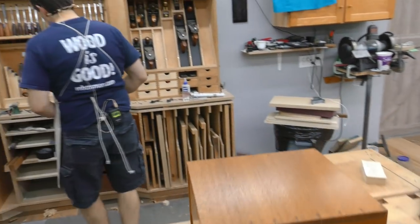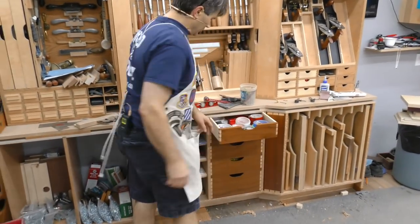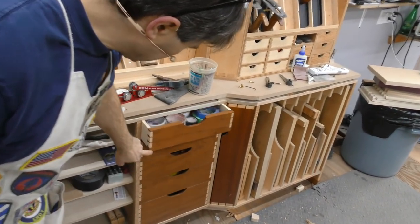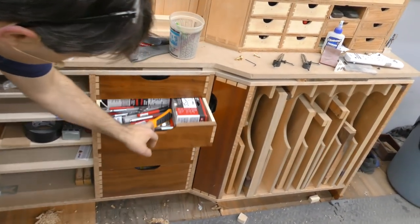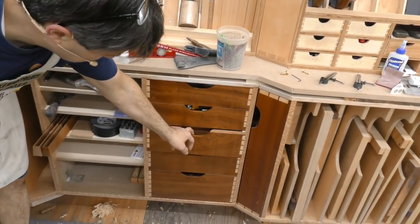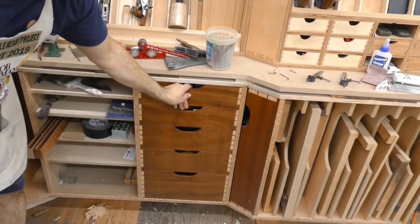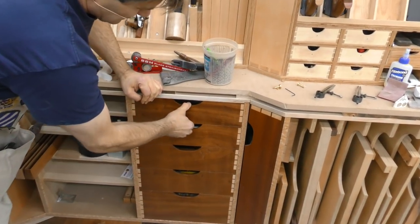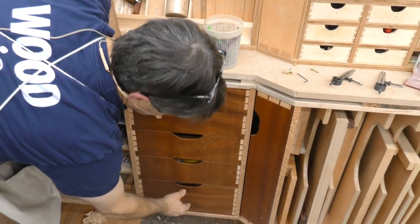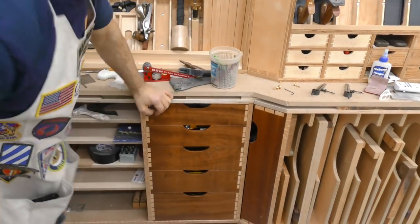I'll show you some more examples. This is a little more utilitarian. The only thing I did differently here, I brought the dovetails all the way through, but they all operate the same way. No side to side slop at all. Close it from just pushing in on one corner — I can't detect any side to side movement. But of course, as I mentioned, there's got to be a little movement top to bottom.